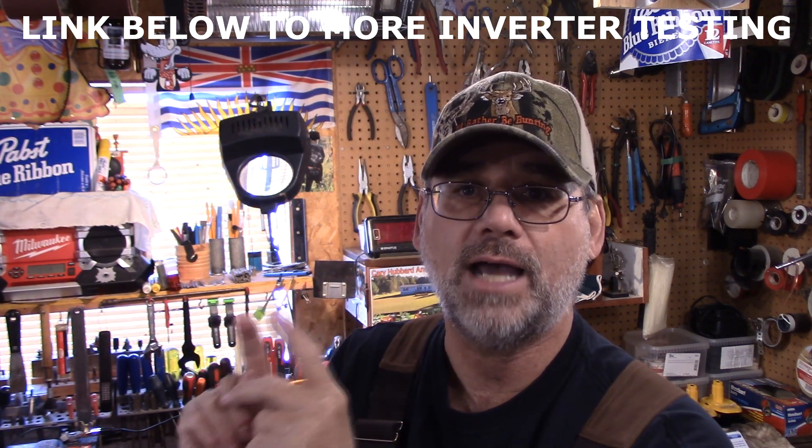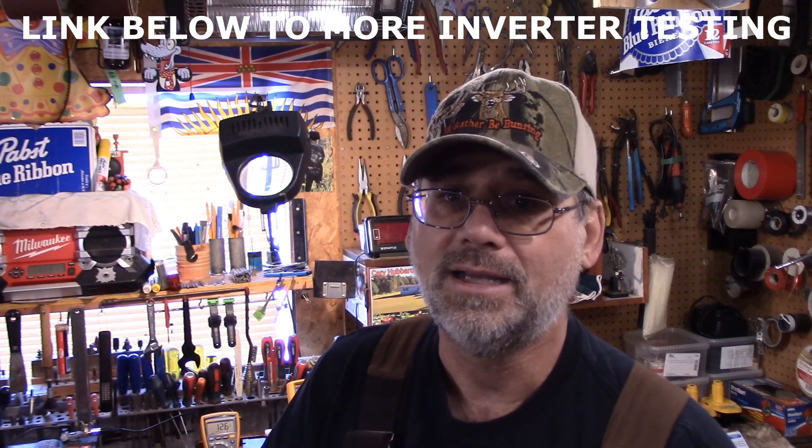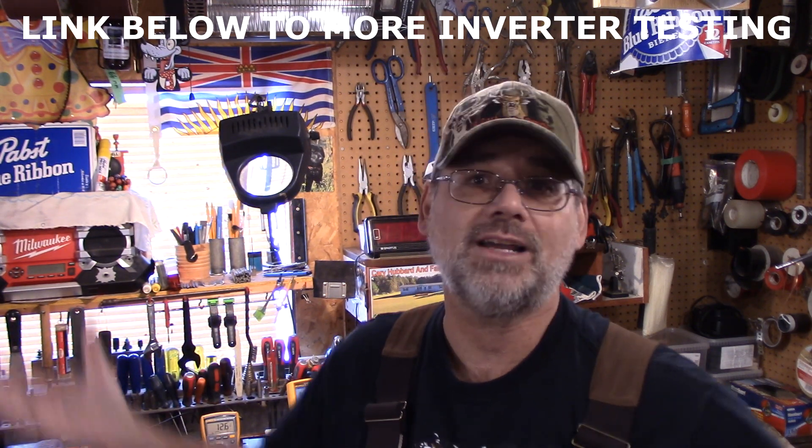There's a lot of things with inverters you have to be careful about. Read the instructions — though I'll tell you, the instructions on these are not very good. There are lots of videos out there that explain inverters and how they should run. Can you join two, three, or four ports together and get the full capacity? No, you can't. As the amperage creeps up, you're going to trip one side or the other — each port can only take a maximum of so many watts and it will just shut down. They do make inverters where on the far side, away from the receptacles, there's a block and you can get maximum wattage out of that block for the whole inverter — but that's a more expensive inverter to buy.